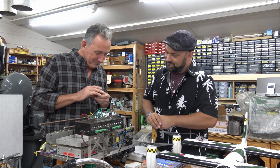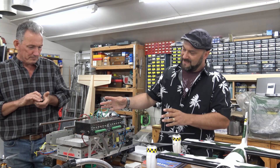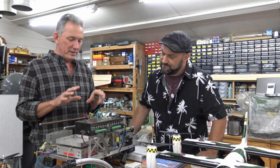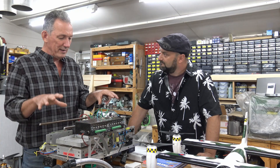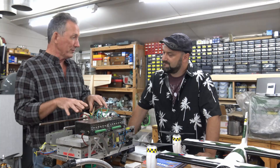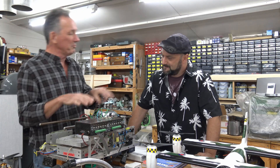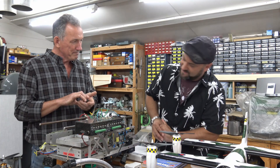On your rig there's quite a lot of electronics — what looks like a microcontroller and a display, plus various pipes and bits and pieces. What are you doing on the outside of the jet engine? Very little of this is actually needed for the functioning of the engine — it's here for research and development. Having calculated what it should do, this tells us what it is actually doing. We design it, say this is what it should do, then test it up and say 'okay it's close' or 'we've missed something somewhere.' This is basically a test rig giving you the ability to look inside your engine and see what's happening.